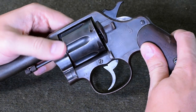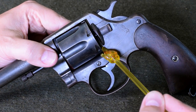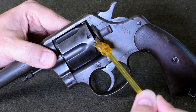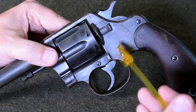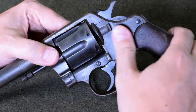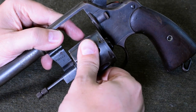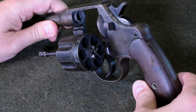You may notice from the outside that the cylinder looks like a shaved cylinder from .455 — look at how close that cylinder stop is to the back wall. But since this is actually supposed to be an American gun, that means this thing is set up for .45 ACP, intentionally done with very little walk — about half a millimeter. So this is the original stop for .45 ACP; this gun is meant to be in the cartridge it's in.